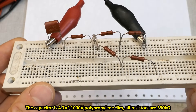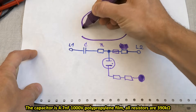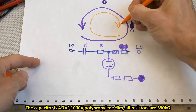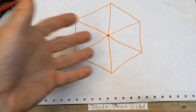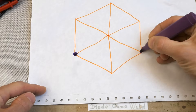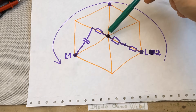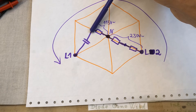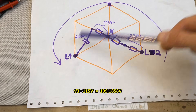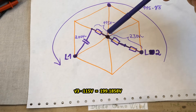Here's what I've built on this breadboard. There's the third phase, which is not probed, but the neon lamp does not light up if the rotation is one way, and does light up if the rotation is the other way. I should mark it based on which direction makes it light up. Let's draw the phasor diagram — here are the three phases and here's neutral. In the counterclockwise direction the voltage cancels out at the center point, bringing it to essentially neutral level. You have 230 V from phase to neutral, half of that (115 V) across the resistor, and about 200 V across the capacitor — half of the phase-to-phase voltage, or 115 V times √3. In this situation the lamp does not light up.